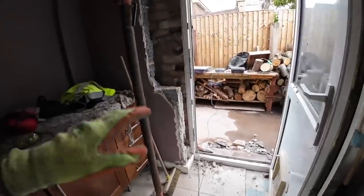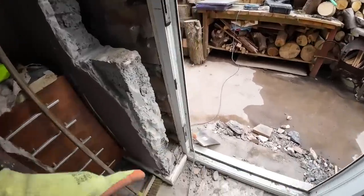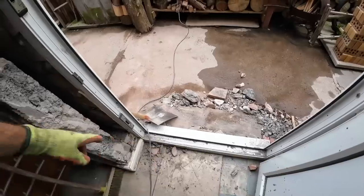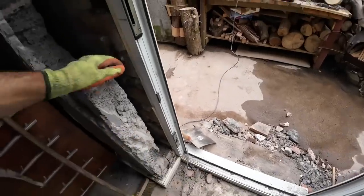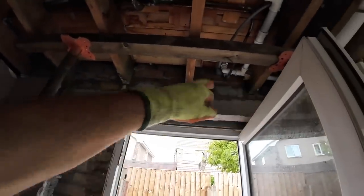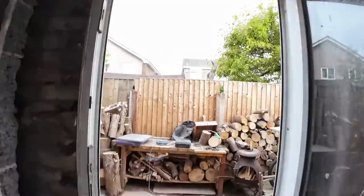So, yep, the door out, this out, brickwork up, blockwork up. We're going to cut the cavity out as well, if there is a cavity there, because obviously there's no door there anymore. Lintel's all done. I just need to pack up the joists with a bit of slate so we can take the acros out, and that's all finished, complete.